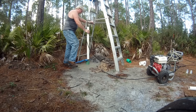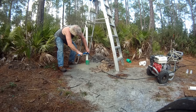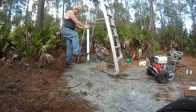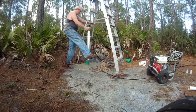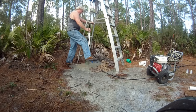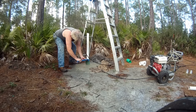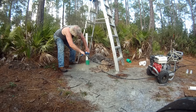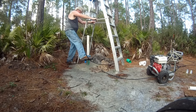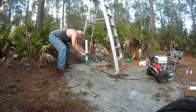My technique for drilling and moving this pipe downward through the sand is pretty much mastered here after 20 feet. This 10 foot section of pipe took about 7 to 8 minutes just to move it down 5 or 6 feet. This was just above the water pocket and appeared to be a shoal layer of sand. The last 3 feet of pipe went through like butter. This was an indicator that the shaft is down inside a large pocket of water.